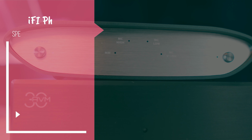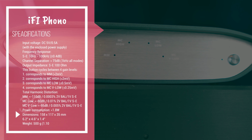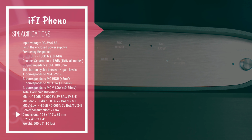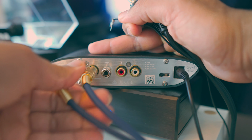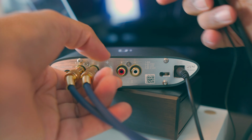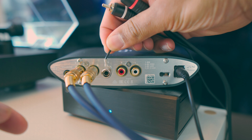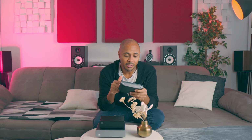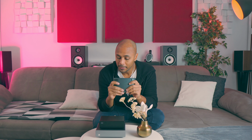The iFi Phono is suitable for moving coil cartridges with output voltage from 0.25 mV up to 2 mV. That means we have the possibility to choose between four gain settings. On the back panel we can also find the balanced output and single-ended RCA input and output. So you have absolutely all you need to run any cartridge. Internal circuits are always very clean. I will leave the link in the description so you can look for more details if you would like.